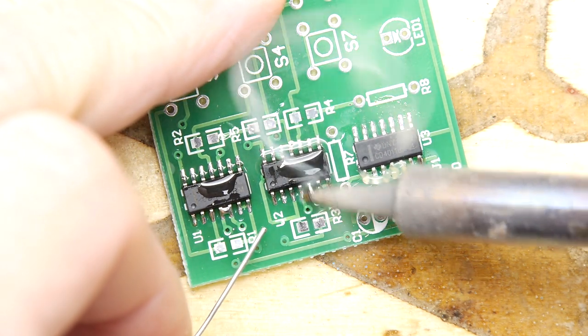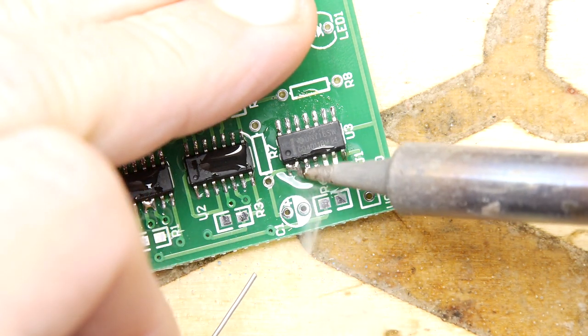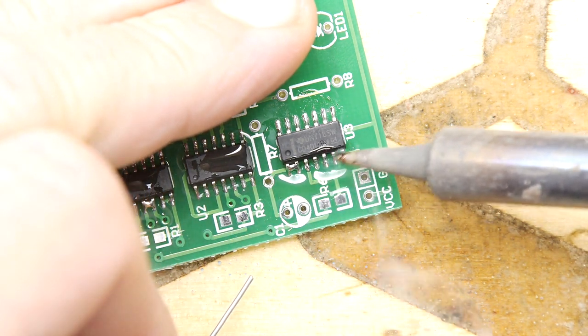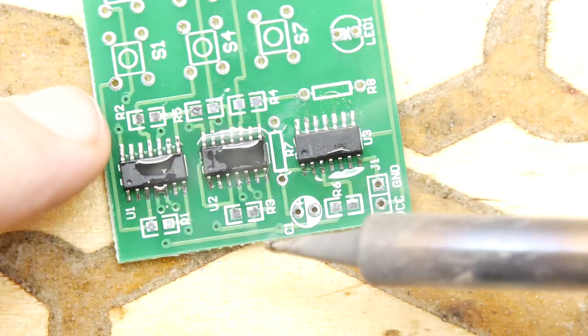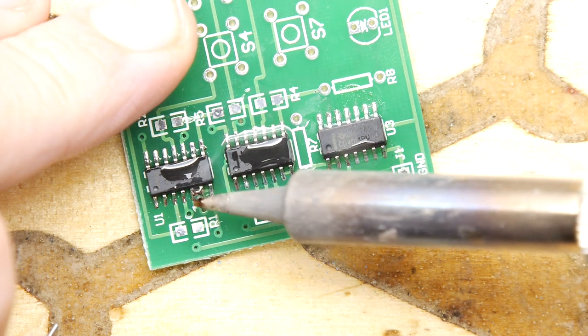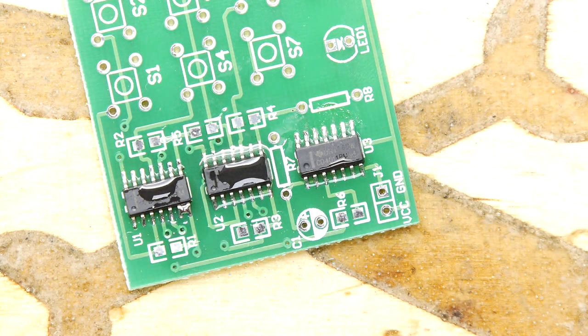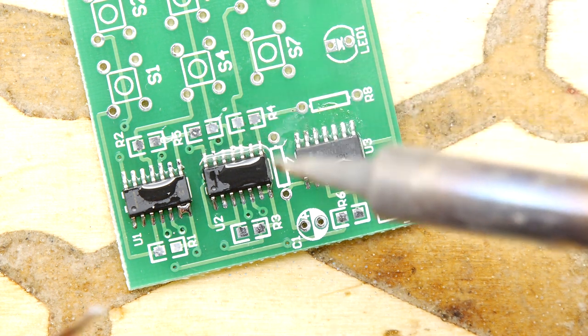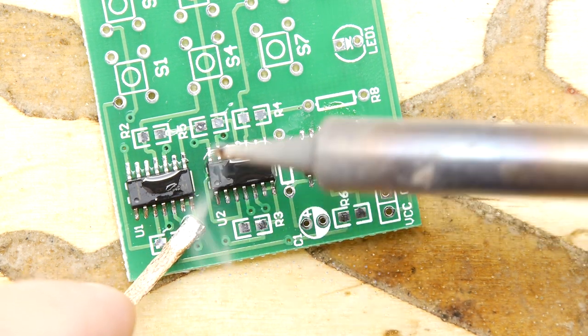Beautiful. Drag it through. You know you want to go over there. Come on now. Beautifully soldered. It's just this one here I could do without. It's got one bridge. Now, he doesn't want to be released of his bridgely duties. That's fine. We'll just give a little bit of braid here. Suck it up. We're done.